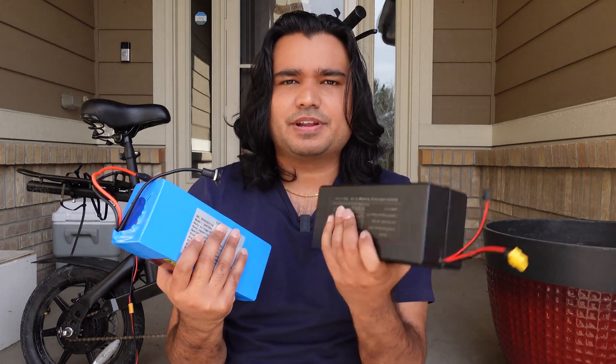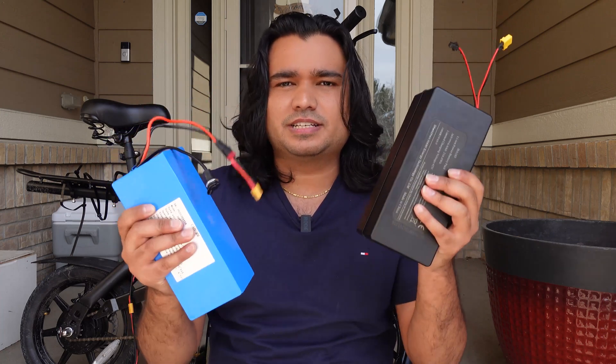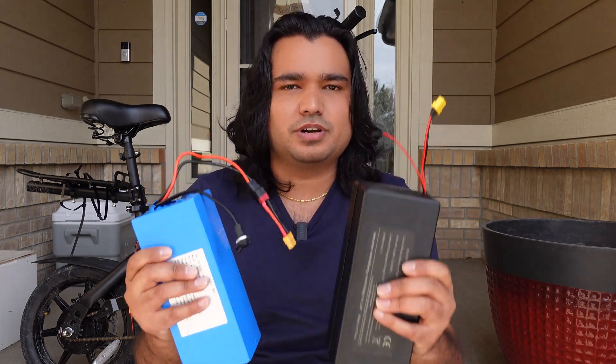Both of these batteries have different internal resistance — each one has some series and some parallel cells inside — so the current passing through each battery is going to be different. I personally wouldn't feel comfortable doing that. I will do a demo on how you can do it, but again this could just be my personal preference. You might think it's fine, and other folks out there might too — it's totally your comfort level. I just warn you that paralleling batteries is more complicated than it seems, and there are definitely dangers associated with it. Do this at your own risk.